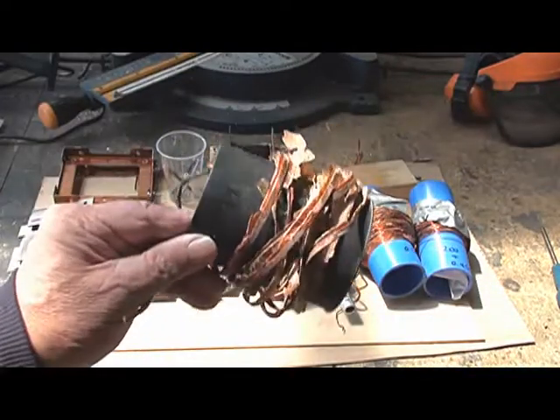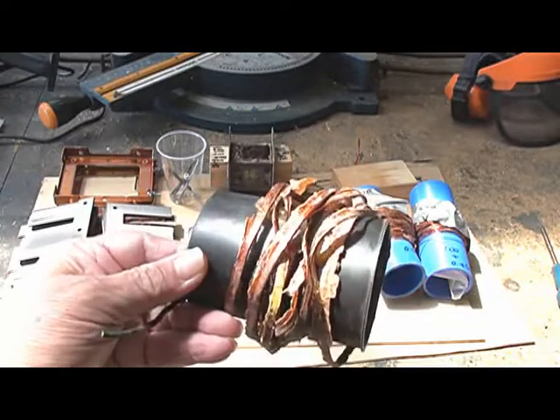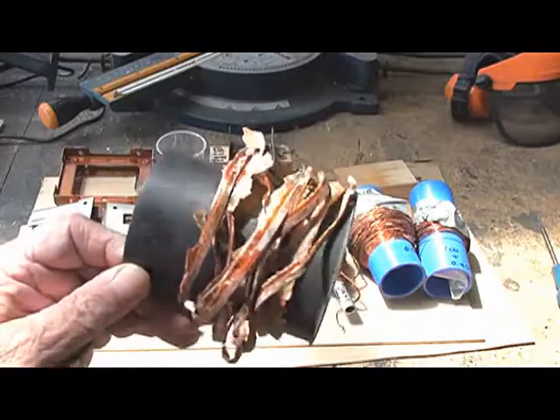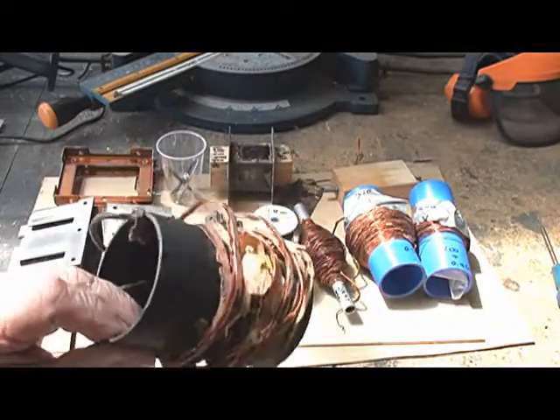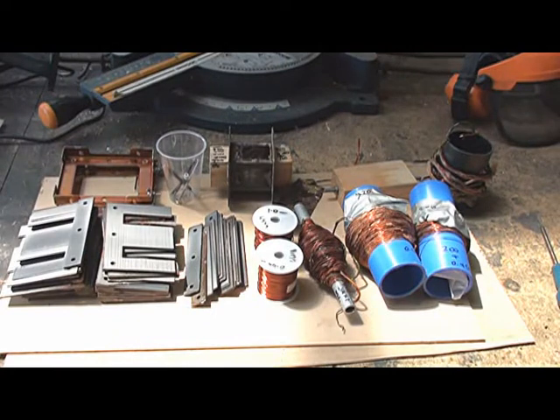The 6.3 volt winding — I'm not sure about that one. The thing you have to watch is that if you want to reuse it, the lacquer isn't broken anywhere — a shorted turn there would be quite disastrous. But you can get a suitable wire of a gauge that will give you 10 amps. There are nine turns there, and all of these turns gave me the turns per volt, which is very important. The next stage is to fit the new wire on the bobbin core and apply some insulation between layers wherever needed. For that I'm going to use baking paper, which is designed to stay in an oven without catching fire up to several hundred degrees — probably even better than the original paper that was in this transformer, although there was no paper between individual layers, only between the high voltage and the low voltage ends.